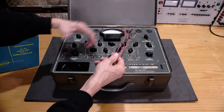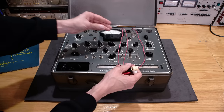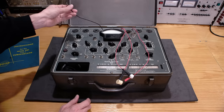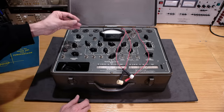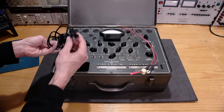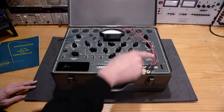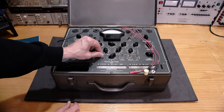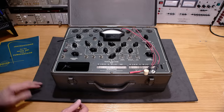You can see a whole bunch of leads attached to the top here — plate leads — and these are not original. There's also a taped-off grid lead, which definitely doesn't work because many tubes to be tested will have a grid cap, so we'll have to find out what's going on. The line cord has obviously been replaced — that's a pretty modern-looking device. Different screws around the perimeter too. Switches are nice and positive, spring-loaded, no problems.